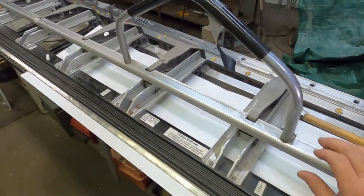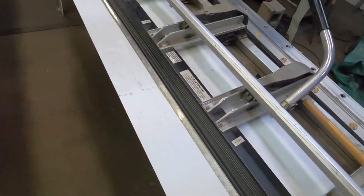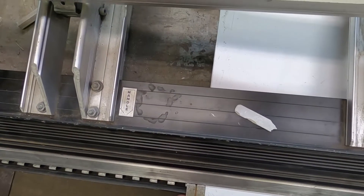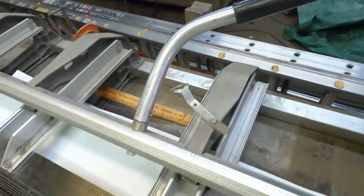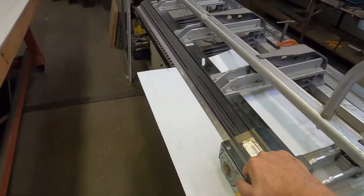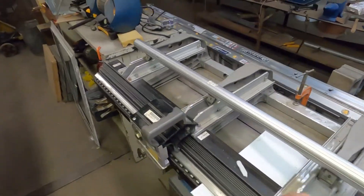This roofing supply store does not have this kind of drip edge, so you're basically stuck with using pressure bar up against the brick wall — an inch and a half. Or I suppose I could make my own. I only need 15 feet.